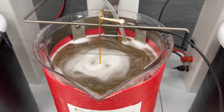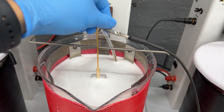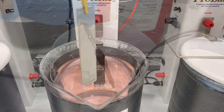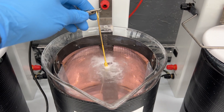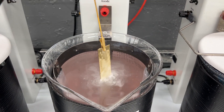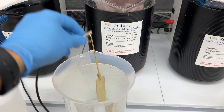To plate with TriVal, you will need to do the first step in the electroplating process, which is electrocleaning your part so it is wet out properly. Now that your item is wet out properly, we will use the TriVal as our activator. You can see that as we activate our part, it will bubble. As we take our part out of the solution, you can see that very thin layer of gold being deposited onto our item. Next, you will need to rinse off your item and you can move on to the next steps in the electroplating process.